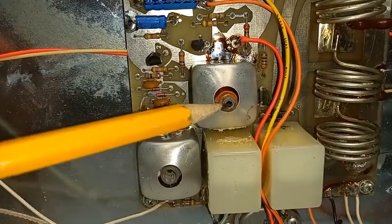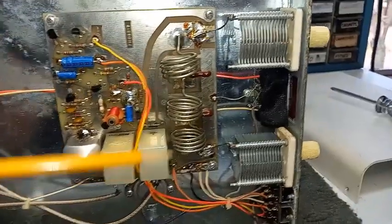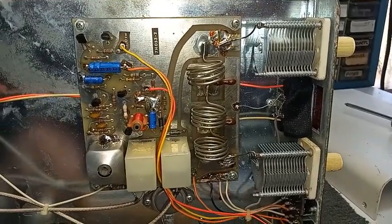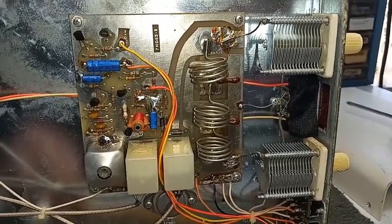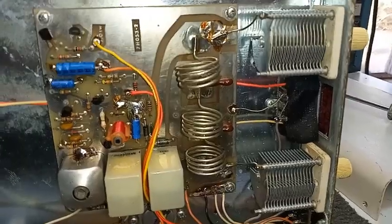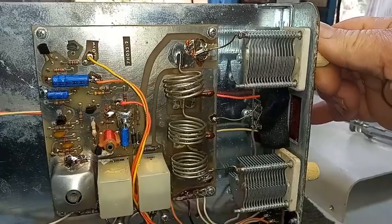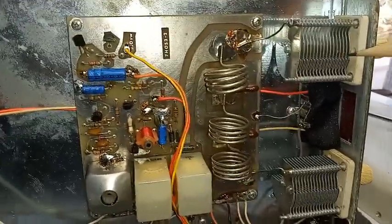We've got two IF coils for peaking the receiver preamp circuitry, then we move on to the antenna tuner section. Even though the BC-2000 antenna tuner is rated at 400 watts, my advice is don't go there. PALSTAR makes an auto tuner for the amateur radio crowd rated at 10,000 watts — are they worried an amateur radio operator is going to throw 10,000 watts into it? No. When initially tuning into an extreme mismatch, these air variable capacitors endure the forces and strains of much more than the actual wattage being fed in. The last thing you want to do is arc these air variable capacitors.